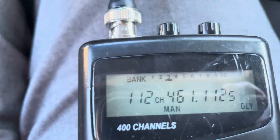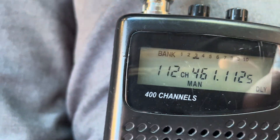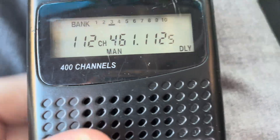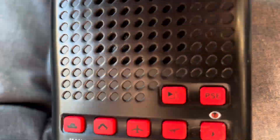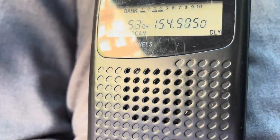it's going to basically work from ballpark 148 to 155, 160 megahertz. And then it's also going to resonate at three times that frequency, which gives you UHF 70 centimeters — FRS, GMRS, the 450 to 470 band, as well as the 70 centimeter amateur band.